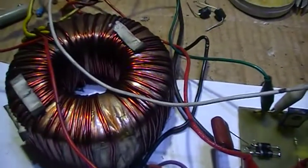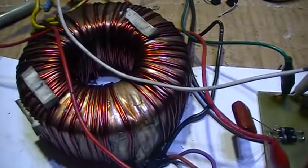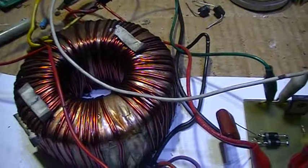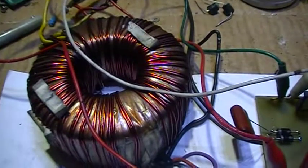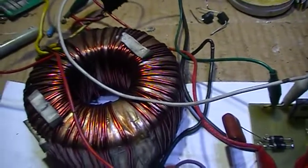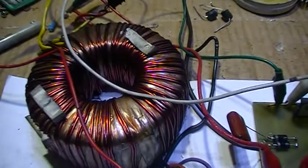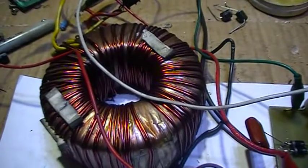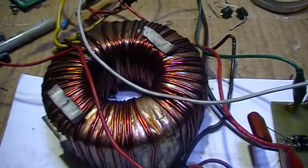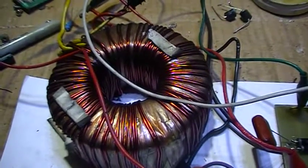I've also got together a transformer — I just pirated the biggest toroidal transformer I could find and re-wound the primary to suit the turns ratio. Ideally it would be three times the size of that, but for loads up to about 500 watts it'll do for testing purposes. I've had the idea of using alternator stators — removing the windings from a couple of alternator stators, tying the two together, and using those as a toroid core. I'm going to give that a try.